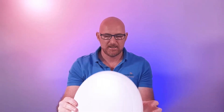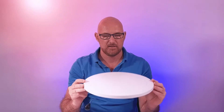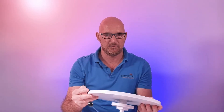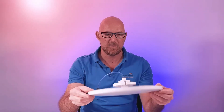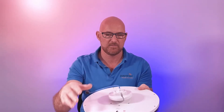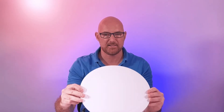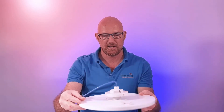The third antenna in our range is the Blackhawk 4G 5G slim series large ceiling antenna. It comes in a large size as well as a medium size, with 2 to 4.5 dBi gain. A back plate is available to place inside the ceiling cavity, which helps further enhance the gain as well as spreading the signal out in all directions. It is also low-PIM.